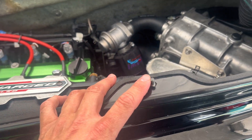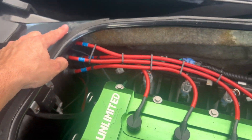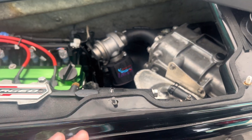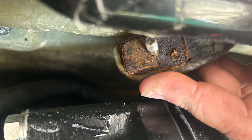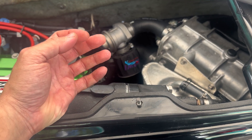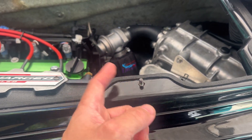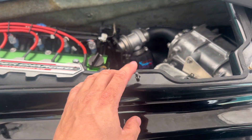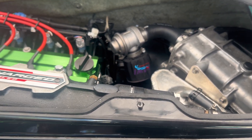Just to give you guys a recap: we have six studs on the new Kawasaki Ultra 310s and Ultra 160s. These studs can break — I had one break. The wadding of glue underneath gave way and the stud just came right out. The stud basically dissolved when it came out. Luckily, Kawasaki sells those, so I was able to buy one and reinstall it. The stud itself appears to be stainless steel, but the little bracket is not stainless steel — I can tell because the previous one that was here dissolved.